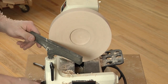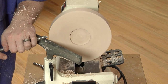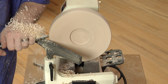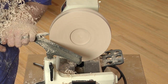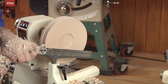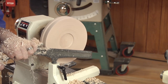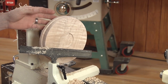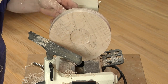With the recess completed, all we need to do is true up the rim of the outside. We'll use the bowl gouge again and make cuts from right to left, with the flute open to about 45 degrees. This should finish up about seven and a quarter inches in diameter. It's not necessary to cut all the way to the end — we'll remove this material later. If you do cut to the end, it risks tearing off when you reach the edge of the blank.